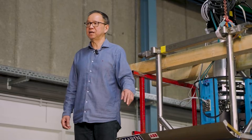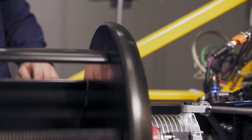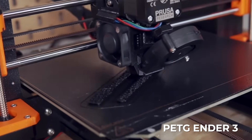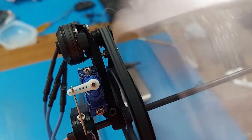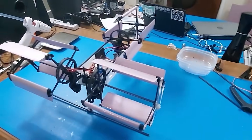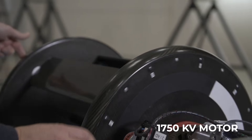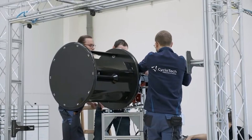After many prints, failures, and redesigns, I returned to a layout close to my original rotor — this time smaller and shaped to work with a standard racing drone motor. The belt drive gave it a smoother sound and removed the harsh gear noise. All parts were printed in solid PETG on my Ender 3. Each bearing pressed into its mount with a tight snap. The blades were hand-cut from foam holding a small carbon spar down the center, and I sanded each blade into a rough airfoil shape. All parts slide onto a 4mm carbon shaft that does not spin. The end plates spin around the shaft, and the shaft connects to a servo to rotate the entire thrust vector. The belt gives a 7-to-1 reduction from the 1750kV motor, powered by a 4-cell lipo.